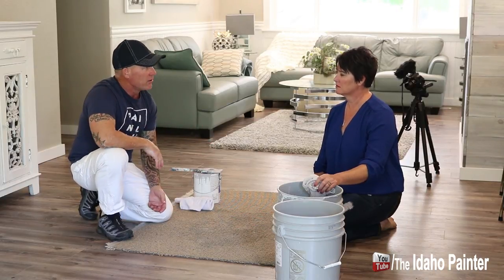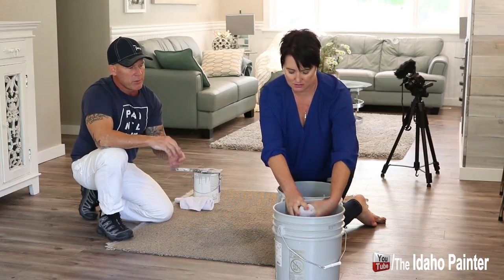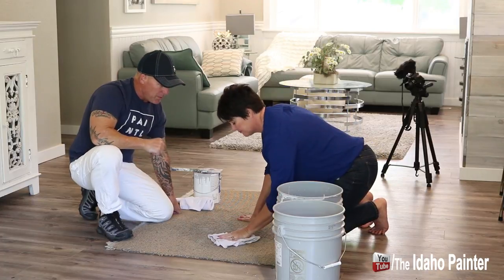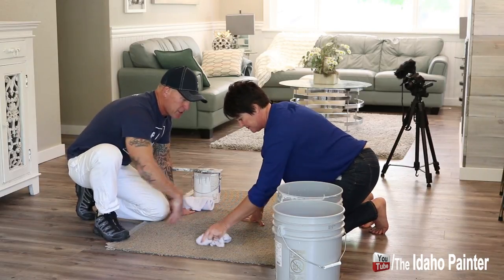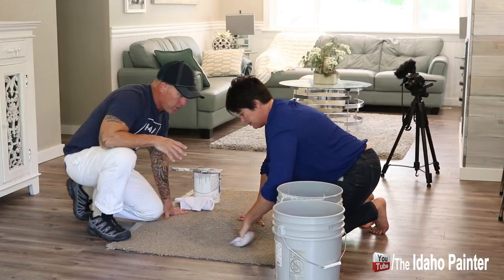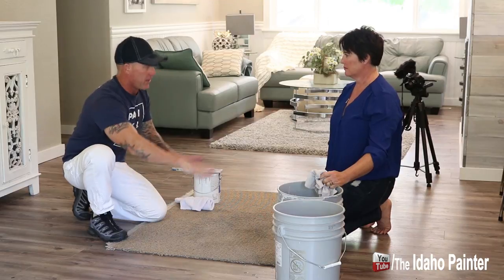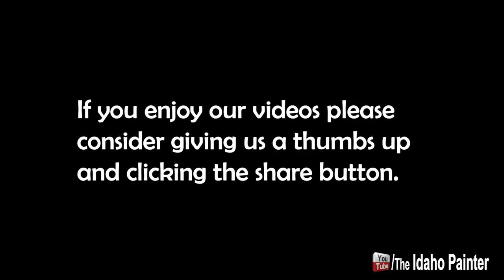Maybe about two more percent — dip it again, give it one more pass. You want to dip it in there, ring it and squeeze it. As you start to get to the final steps, you want that rag to be really clean. Now put a lot more force. You don't want to always scrub in one direction — you want to scrub in multiple directions. When you're all done, if you want to really hide this well, get the carpet lifted up in the pattern like right there. Now the carpet's all lifted up. Now it's going to dry. You don't want to put anything over the top of it — you want it to be able to dry really fast and air dry. I don't use any hair dryers or anything that could get too close and melt the carpet.